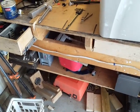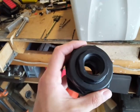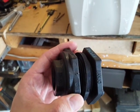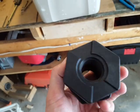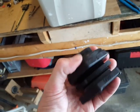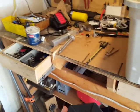You're gonna need the heating element, which I already showed you, and then also you're gonna need a bulkhead fitting like this. I think this is an inch and a half bulkhead fitting and I got this off Amazon too. It's made out of EPDM — it says it right there — and it's made by a company called Banjo. This thing is pretty awesome; it comes with the seal and it feels like a glass-filled material, it's really tough. We're gonna cut the right size hole in the side of this bin, install the bulkhead fitting, and then screw in the heating element.